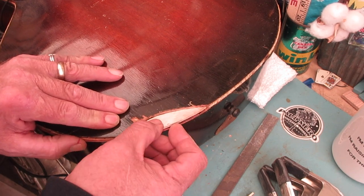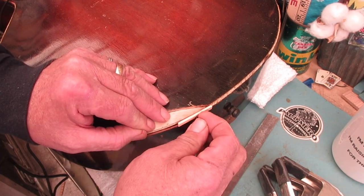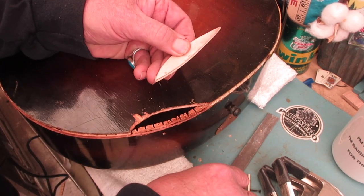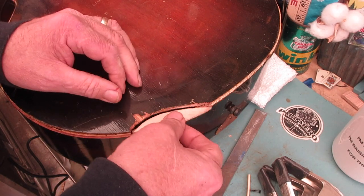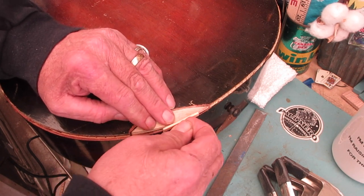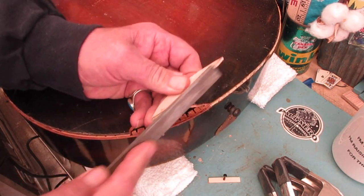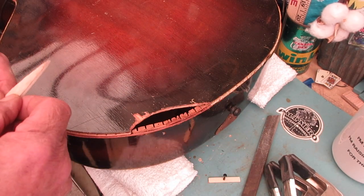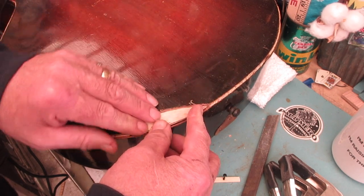Alright, we're off the belt sander. That's going to squeeze in a little bit there. We lay that in — look at that. Big test again, I can't remind you enough: does that fit there? A little bit right there — I can just take this file and work it. But the most important thing is that the binding has room everywhere. I'm going to touch this a little more off camera, but I want you to think about: if we had just cut a piece of wood here and not replaced that kerfing strip, we'd have nothing to glue to or attach to right there.